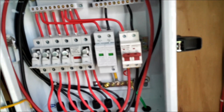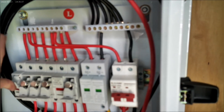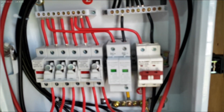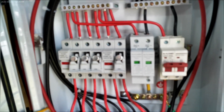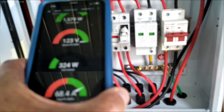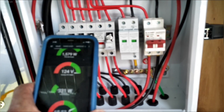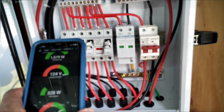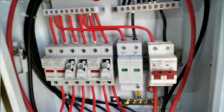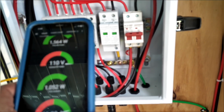So together these two side strings aren't producing a whole bunch right now, but in the evening when the sunset side and back panels get hit, this number soars up. During the day they're only producing about 300 watts — 330 or so — not major, but then you add in the top panels which are the big producers during the day and we jump way up over a thousand watts when the Sun is out.